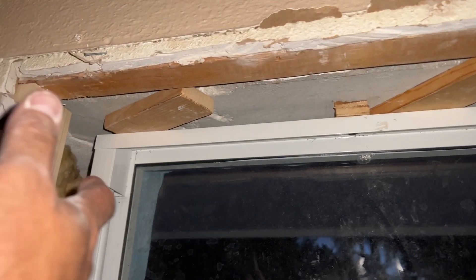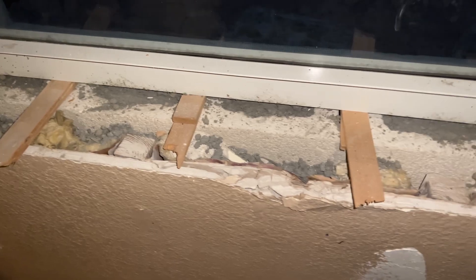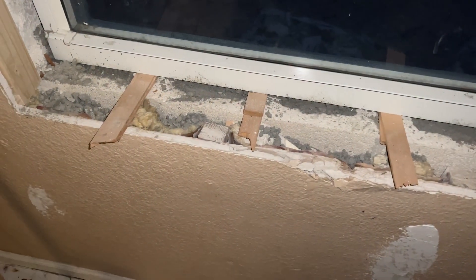Update: we custom fit a 2x4 in there. We put that one in with a screw and that one in without a screw. These are going to hold the drywall up. We're just going to drywall right down to there. I'm going to do wood across the bottom and add a little more wood in here. Then we cut a piece of sheetrock there, put this one on next, do this side, throw a board on there, do molding around the outside, hide all that and close it up.